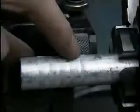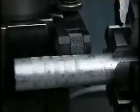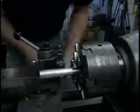Okay, now both wheels are coming into contact with the part, and we are getting a uniform crosshatch. Now I plunge the tool into the part and wait for several revolutions for the teeth to settle down into the part before engaging the feed. Now you can see the tool feeding down the part, leaving the knurling behind it.